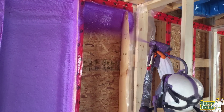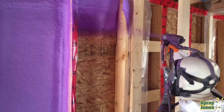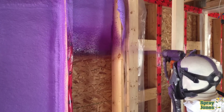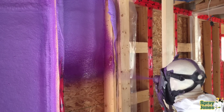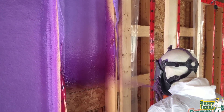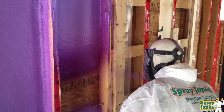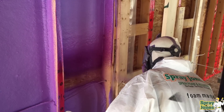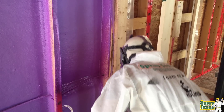Then the big subject is gun cleanliness. If you're having clogging in the screens or buildup on the front of your gun, you're going to be fighting a pattern all day long — really hard to put on even, consistent foam because it's heavy to one side all the time. The first thing told to me almost 20 years ago when I started spraying foam professionally is that a good sprayer is continually adjusting their technique for how their gun is spraying. A good sprayer isn't throwing a fit every five minutes just because it's a little heavy to one side. You hold the gun a different way, change your technique, or change your timing.